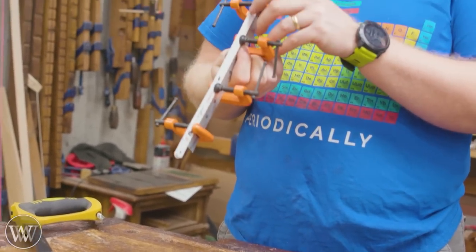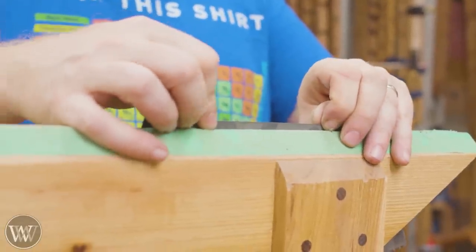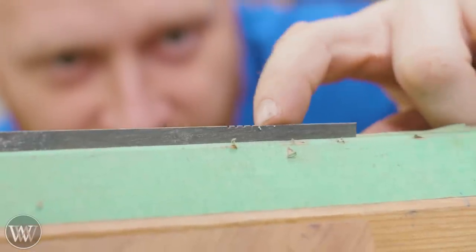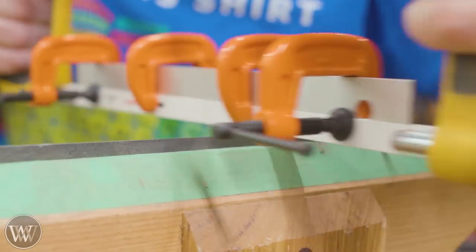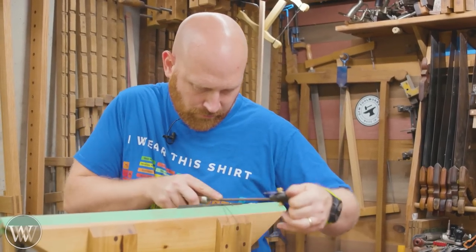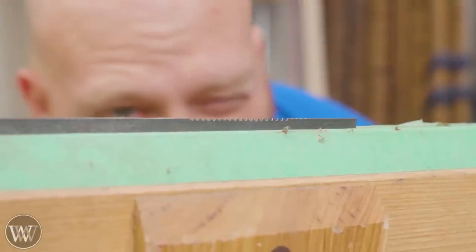I also have lots of other links on how to sharpen the teeth, how to actually cut the teeth, and more things like that - so if you want more than what's in this video, there's a lot more information down there. We can lock this all into the hacksaw and then experiment with this plate. It's always best to do experiments - I have a lot of old saws that really aren't worth keeping, and those end up turning into scratch stocks or card scrapers. You can see how the spacing is right about there, and I want to cut them all in about a sixteenth of an inch. You can change the spacing by changing the spacer in between. We continue down along the saw to cut in all of these nicks, which lets you know where to put the teeth in. Once you have all those nicks in place, come in with the saw filing file - just like sharpening teeth but a little more work. I'm going to cut all the teeth, come back through and joint them all, make one more pass of actually sharpening them, then set them all, and then come back one more time and sharpen them again, just to make sure they are exactly where I want them to be.